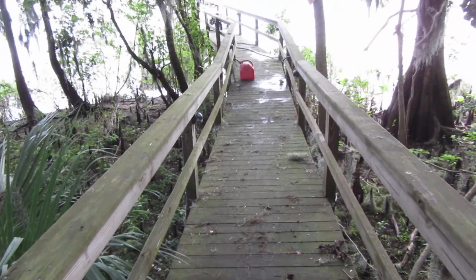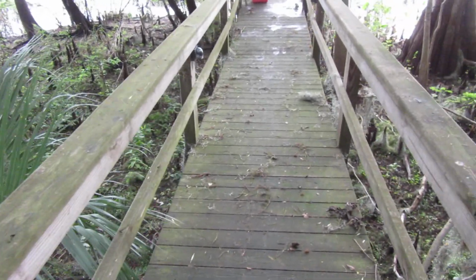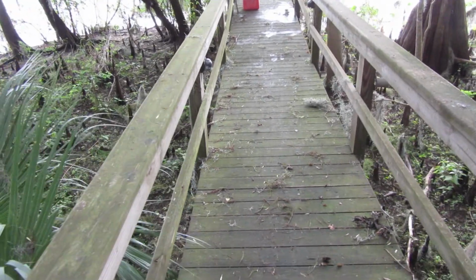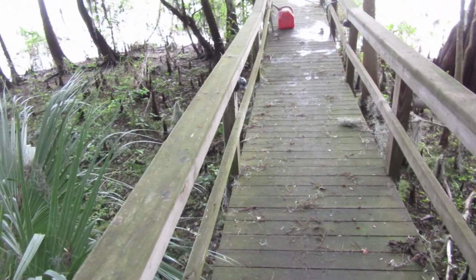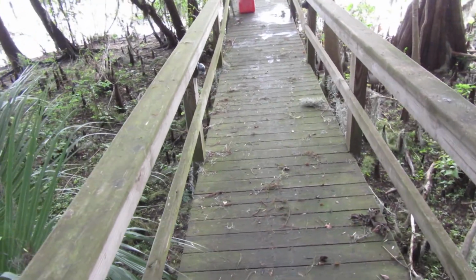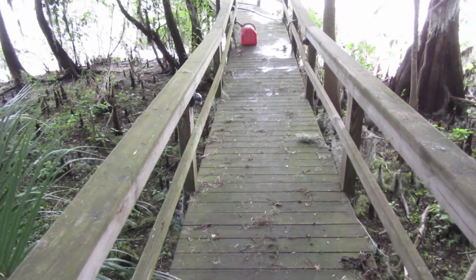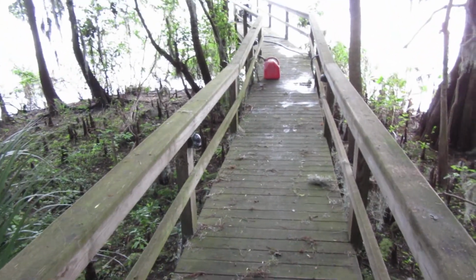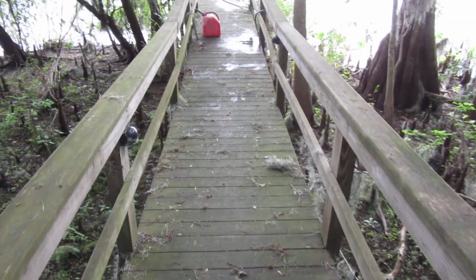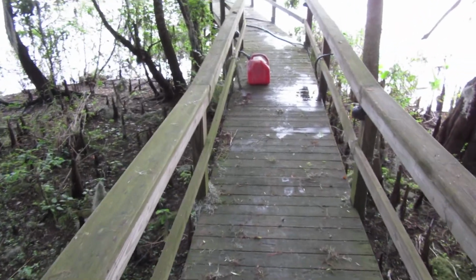It mildews like crazy. I mean, this has nothing on it right now, and look how bad it mildews. I couldn't imagine what it would look like if you had an oil-based stain or sealer on here. It would be like mildew carpet on all this wood. We're going to use a water-based stain and sealer that holds up real well against mildew. It has mildicides and algicides in it. We'll make it penetrate into this wood just as deep as an oil-based stain any day of the week. There's just tricks to doing it.